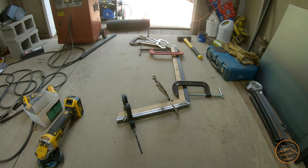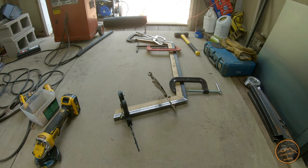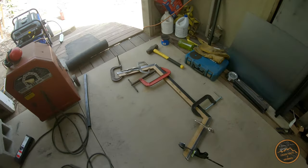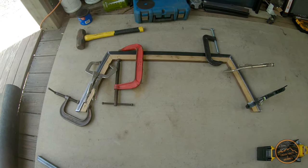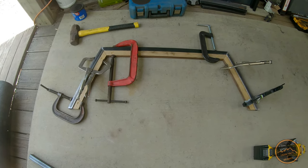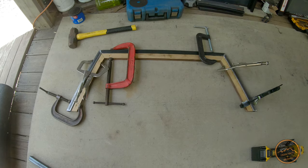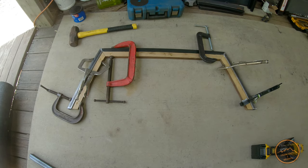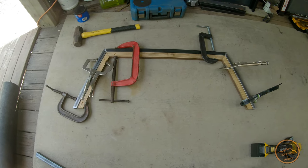Here's the plan on the fenders. I cut a wooden template and screwed it to the floor. I've cut all my pieces and I'm clamping them to that template so I can weld the top and sides and hopefully not get it to shrink and deform. I'm going to make four of these - inside and out of each fender - and then I'll have pieces in the middle separating them, holding them apart before I put the metal skin on them.